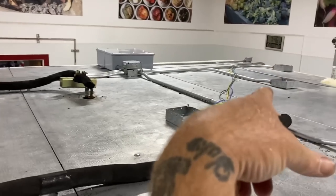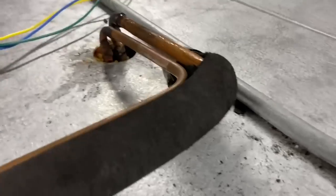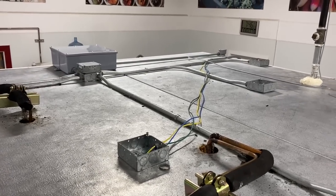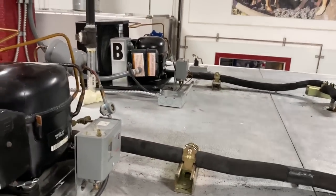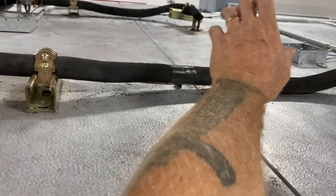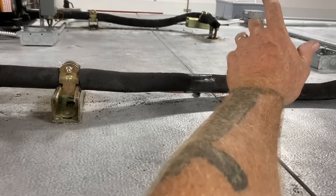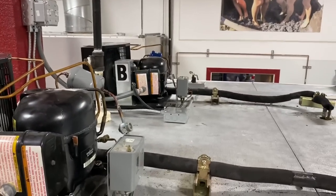The sensors just came across like that, drop in. We still got to tidy those up with some tie wraps and spray foam the holes. These were all cut and left open in the fog, so there was so much moisture in the system. We ran the vacuum pump 24 hours, then still had to take all the TXVs apart and blow them out with nitrogen again, then pull another vacuum. Now we got it to where they're working — that was a long haul.